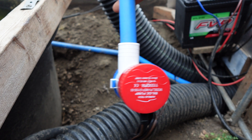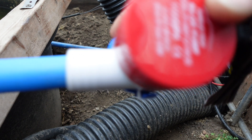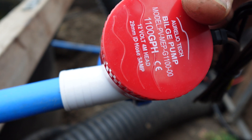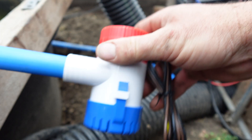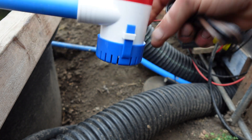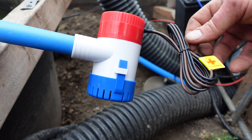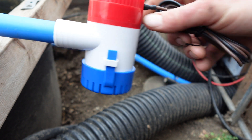These are going to be for connecting our PEX to PEX. We've got our pump here, and I didn't realize that I bought this much flow — it's got 1,100 gallons per hour, 12 volts, four meter overhead, so three amps. That breaks down to about 18 gallons per minute, which is not what we want, but I am going to start with this pump because we do have a decent head lift.